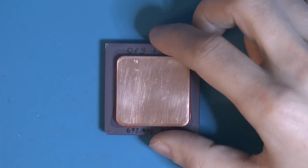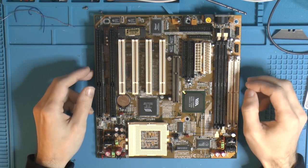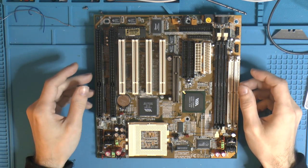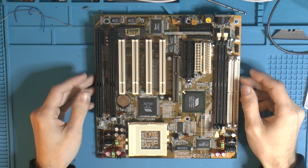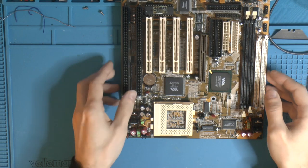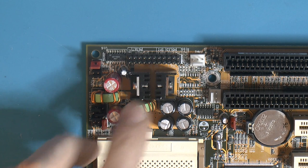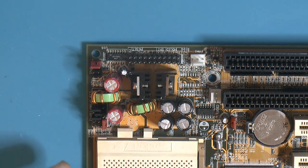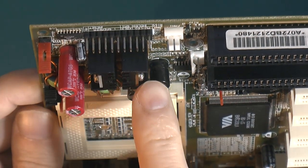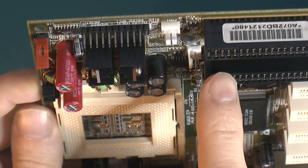This is our CPU we're gonna use for the upgrade of my Super Socket 7 system. Before we move on to actually building the system, there is still something I want to do to the motherboard. I realized we have VRMs over here — this is the Vcore — and we have the I/O over here. We can have a look at the heatsinks here because the MOSFETs for the VRM have heatsinks.